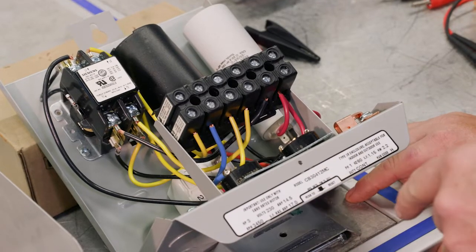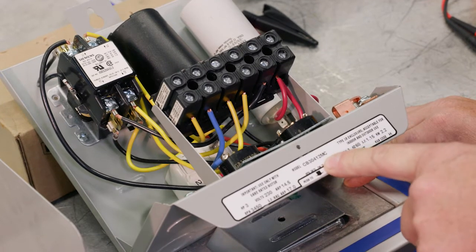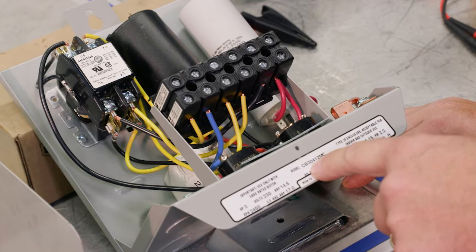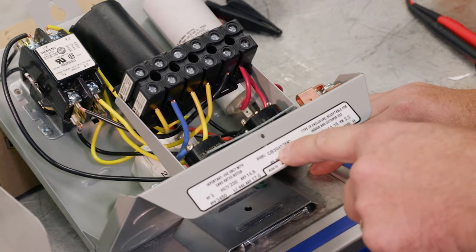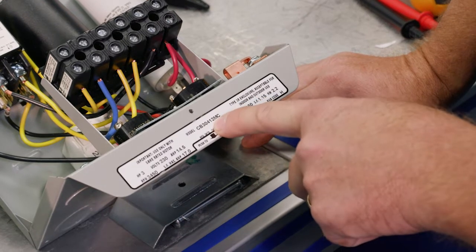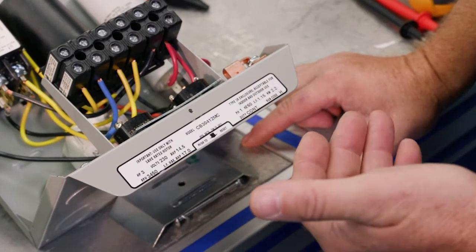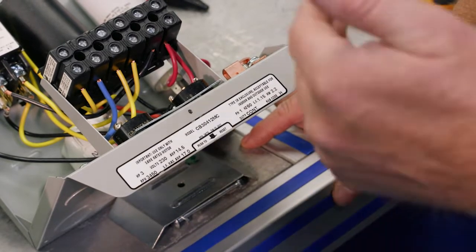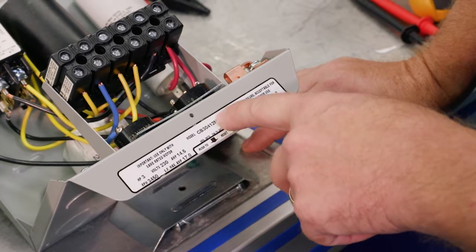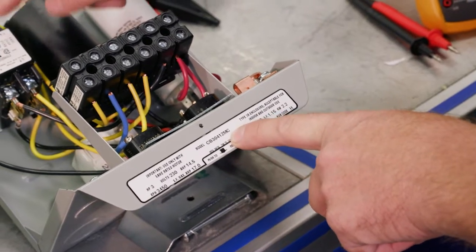The example we're going to use today is a CB30412MC. That is a control box, 3 horsepower, 4-inch motor, single phase, 3-wire of course. With a control box we're talking about a 3-wire and single phase. And the 2 is 230 volt. Now the MC stands for magnetic contactor.